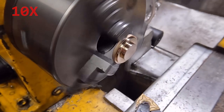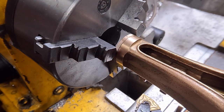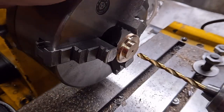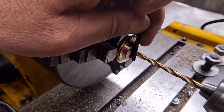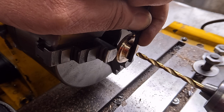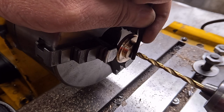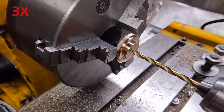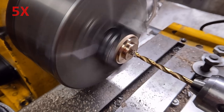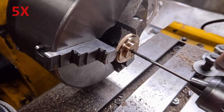Other than the hole for the packing gland — there's a through hole of one-eighth inch, which as we'll see later I probably shouldn't have done at this stage, and then there is a larger hole which does not go all the way through, which acts as the space for the packing material. Here I'm setting the height of the drill above the surface. I'm using a drill that's the same depth as the hole — that was a brain fart. I usually use a one-eighth inch broken end mill to set me to zero, then I go to the specific depth needed, and then I ream the eighth inch hole, which as we see later is a complete waste of time.